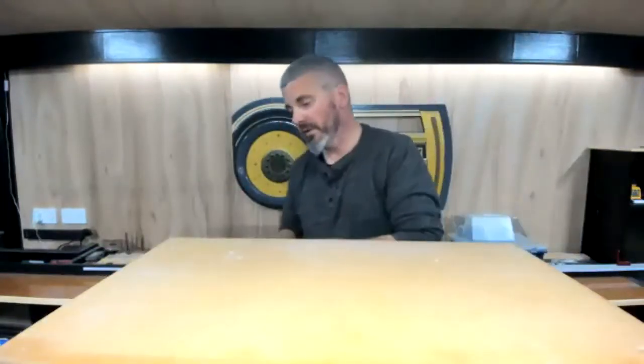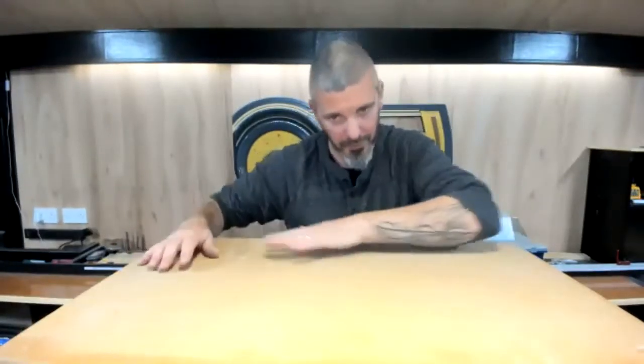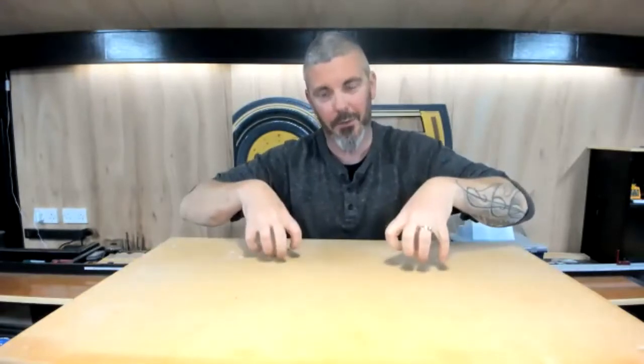Now, once the wall is done, I think it would be remiss of you not to sand down that wall a little bit, just to give it a rub with sandpaper, because depending on the paint that was there beforehand, say you had a soft sheen or a sheen emulsion, that has chemicals in it. By agitating that, by basically scraping along the surface, you're creating all these lovely little grip points so that the next coat of paint will stick properly.